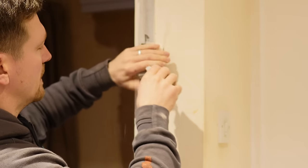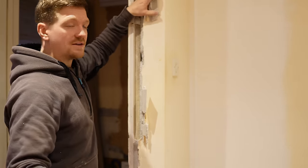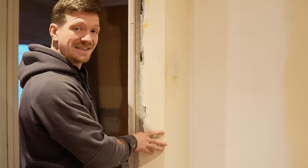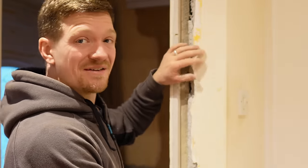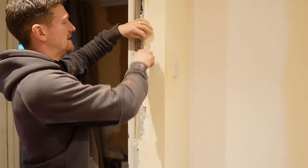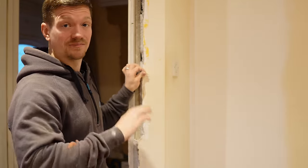Any areas like that need to come back. Literally, with my fingers you can see — all the way up there needs to come back. We're going to search the whole room for areas like this: flaky bits, plaster that isn't fixed to the brick. We've got to get it all off. As painful as it may seem, you need to do it properly, otherwise you'll just fail.